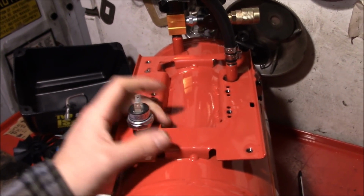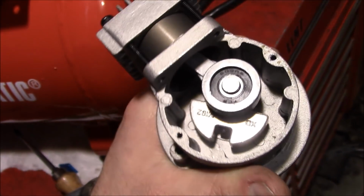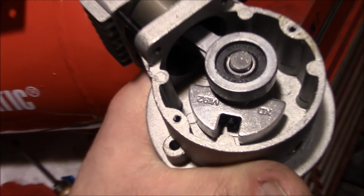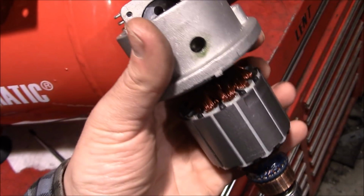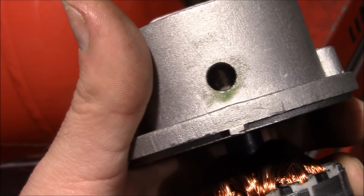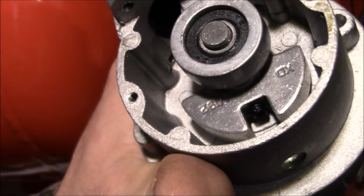Which is good because mechanical systems always trump electrical systems. So we've got the business end here, and upon further inspection, we actually have a little set screw down in there that I suspect is holding on this motor shaft. And that hole right there, which acts as the air intake, is also an access port for when you roll around to that set screw.